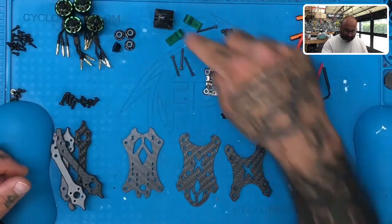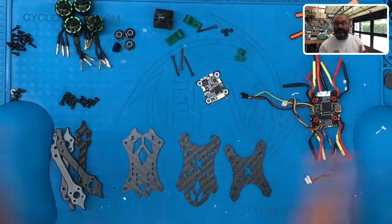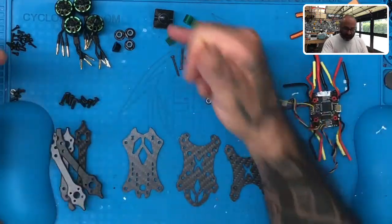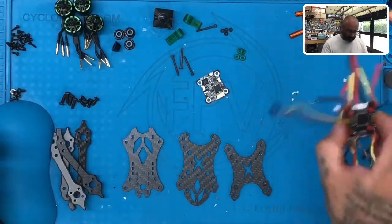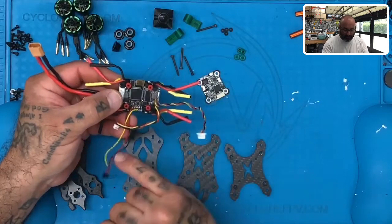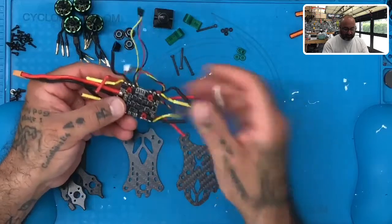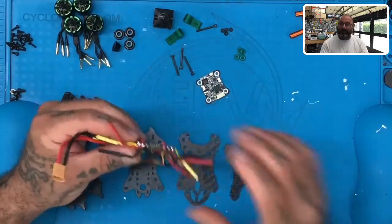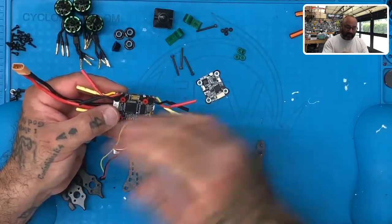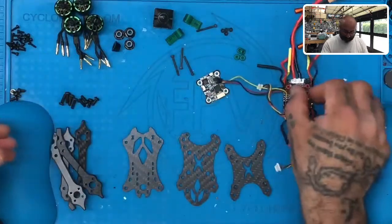This is your VTX, which is going to be plugged into the board. VTX stands for video transmitter — TX is the abbreviation for transmitter — and that's what transmits the video to goggles or a monitor. This is the actual brains behind it: your flight controller. Your processor is right here, your OSD module — on-screen display — is right here, and your gyro is here as well. This also has your ESC, or electronic speed controller, built in. It controls your motors and does everything in one. It's called an AIO, which stands for all-in-one board.